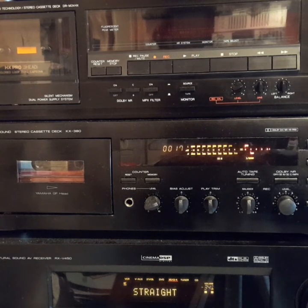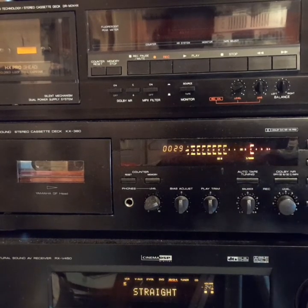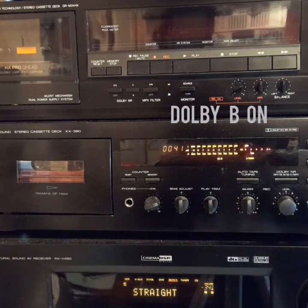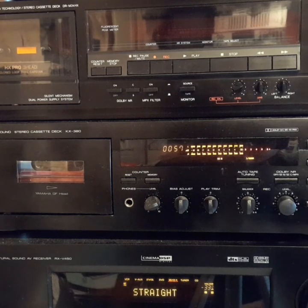This test cassette has been encoded for the Dolby Type B noise reduction system and is largely compatible with the ANRS system. It is not compatible with other systems and these should not be used. When playing this test cassette, the Dolby B or ANRS switch on your cassette deck should be on. If your deck is not fitted with either of these noise reduction systems, there will be no material effect on most of the tests. The music examples, however, may sound a little overbright, and this can be partially corrected by backing off the treble tone control on your amplifier.